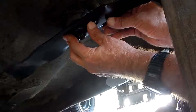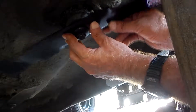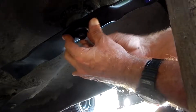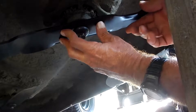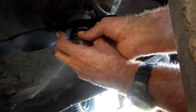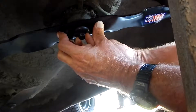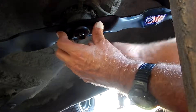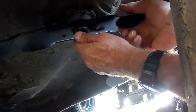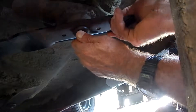Make sure that cutout is the correct one on your new blade. As you can see, I'm feeling it, trying to get it seated. Once I get it seated, then I'll tighten down the bolt. Once you get these blades tightened down, give that blade a complete spin to make sure your deck isn't deformed or dented and that you have clearance for these new blades.